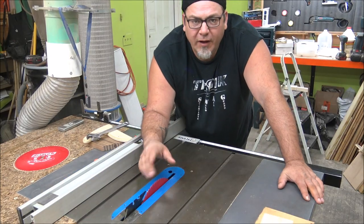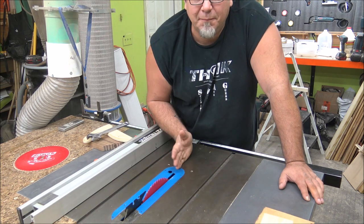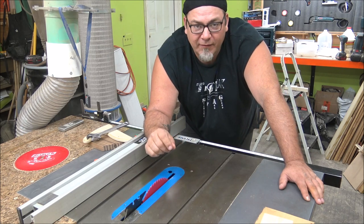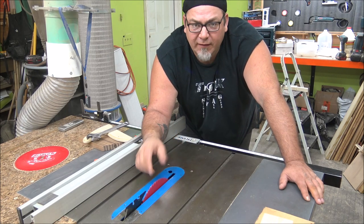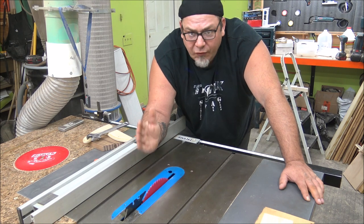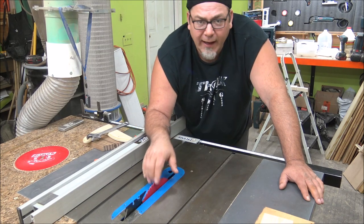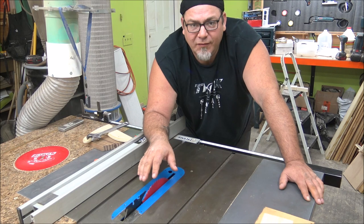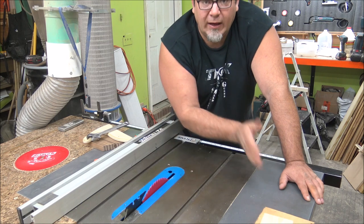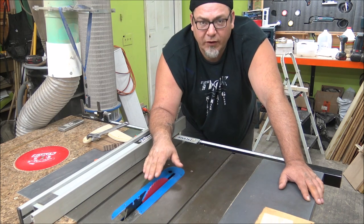When you install a new blade in your saw, the very first thing you should do is plug it back in, step out of the plane of the blade so you're off to the side, and turn it on. I've had some really expensive saw blades in the past dislodge teeth — brand spanking new blades, right off the go. You do not want to be anywhere near the plane of that blade if that happens. I've never had it happen with a Diablo blade, and I know it's a rare occurrence, but I have talked to other woodworkers who've had the same thing happen. Always turn your blade on when you're outside of that plane to make sure all your teeth are secure.